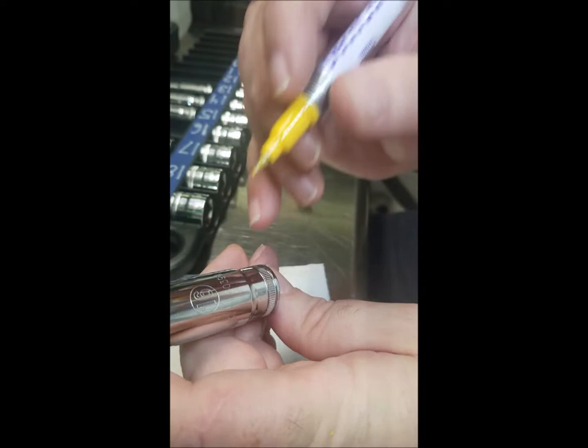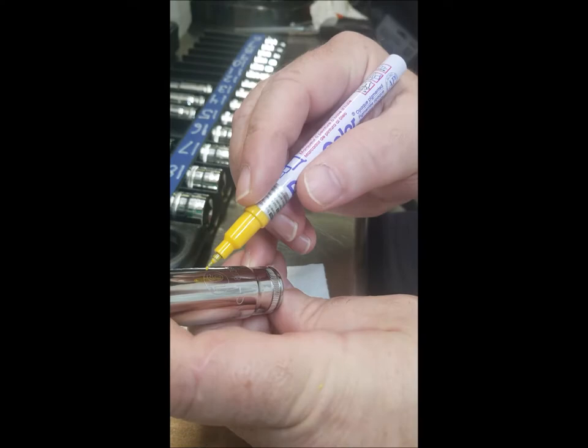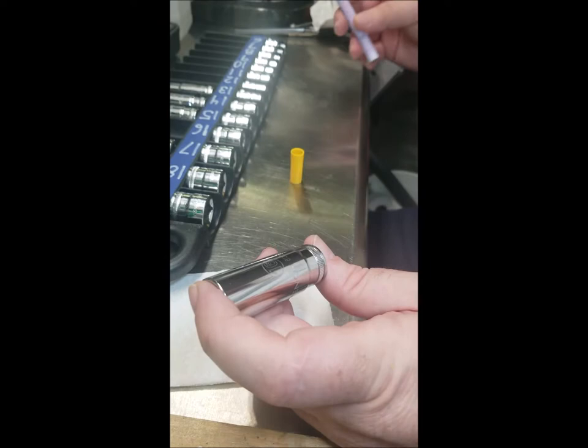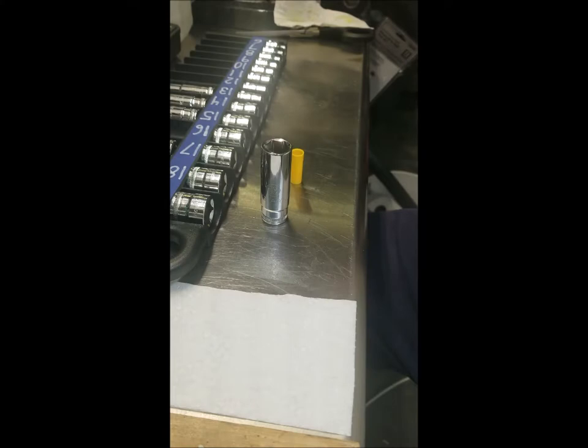Here's what I found works really well: put the paint on about three different sockets, assuming you can move through them pretty quickly. You want the paint to cure just enough to stick in the ridge, but not so much that it's hard to get off the socket. Have yourself a paper towel ready with a small, thin dab of chrome polish already on it — thinly applied — and set that to the side.